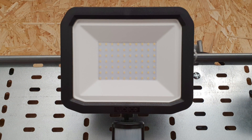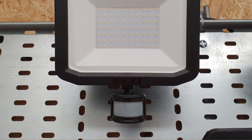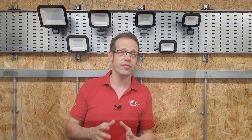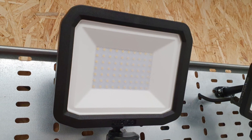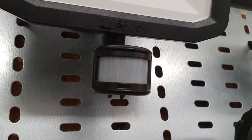Just while we're on security and thinking about the PIR sensor, there are a couple of good features and benefits to that as well. Very often when manufacturers make a floodlight, they'll state that it has a certain IP rating — 65 is the norm. But what's a little less obvious is that a lot of the time the PIR has a different, lower IP rating, perhaps IP44, meaning that the fitting as a whole doesn't have the same level of protection across all its different elements. However, the Castra fitting from Luceco has the same IP rating for both the luminaire element and the PIR as well, meaning that you can be confident it'll survive the elements in an outdoor setting as you'd expect.